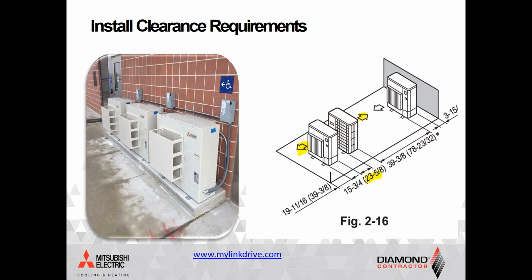And also keep in mind proper clearance requirements when it comes to the P series outdoor units. I always reference that you want to double check on the MyLink drive. Look up any of the installation manuals, engineering manuals, or submittals for that equipment, and keep in mind the distance you want to have between the outdoor unit and the wall, and for outdoor units side by side, whether they're blowing in opposite directions or toward each other, you want to be mindful of those minimum distances. You can see here your 3 outdoor units look to be air conditioning P series models with wind baffles installed.